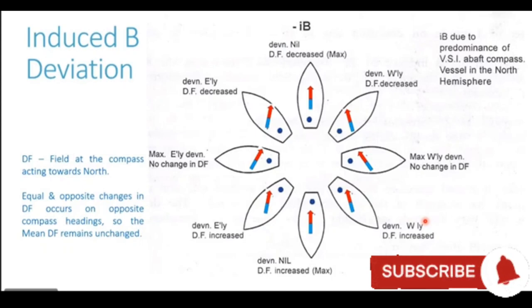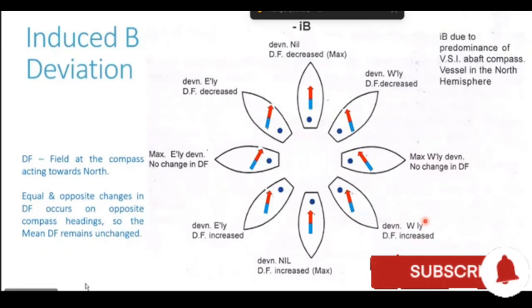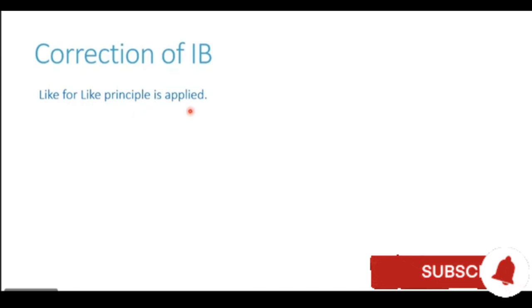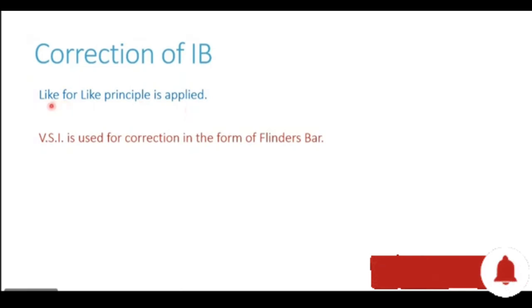So beta, have a good look now at the procedure, the concept behind the correction of induced B. We use the like cures like principle. That means permanent deviation is corrected using a permanent magnet. Induced deviation is corrected using an induced magnet. Now, since this induced B is generated because of magnetism in the vertical soft iron, we will use soft iron for correction of induced B. So vertical soft iron is used for correction and it is used in the form of a Flinders bar.